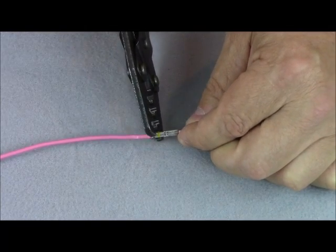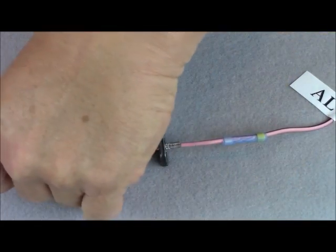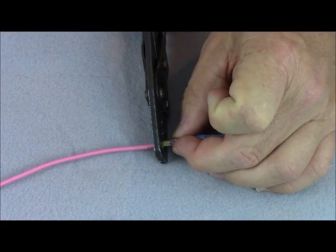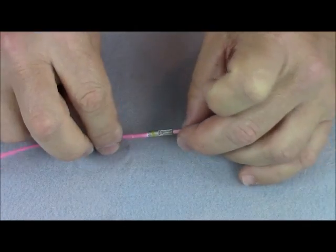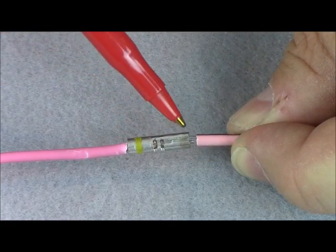We're going to put a small dimple in the other side as well. Another thing to remember is not to put solder into that inspection hole, because what you're doing is creating that mechanical bridge between the copper and the aluminum, and again we're looking at dissimilar metal corrosion. One final inspection — make sure that we have good engagement and yet don't have contact between the two materials.